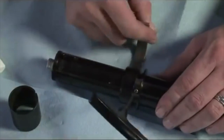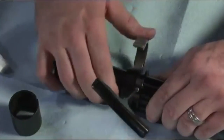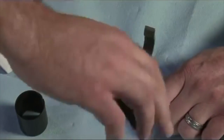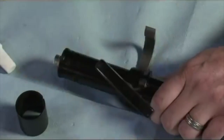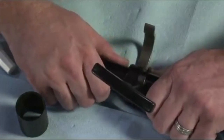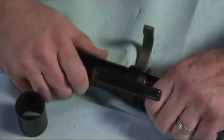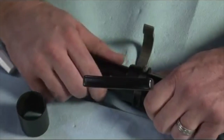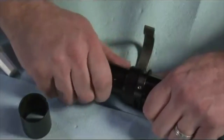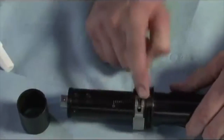Make sure that clamp is open so that you can feel the play in there. Because if it's shut, you get no play, right? Take your set screw down until it stops. Do not wrench on this thing. Just till it stops. There we go. Now I want to back it off till I can move my center post freely and have no play in there. That's it.